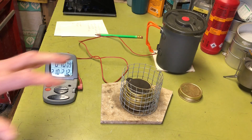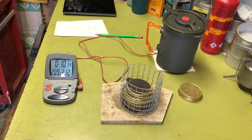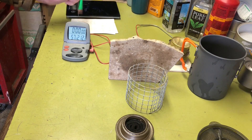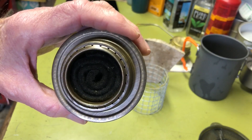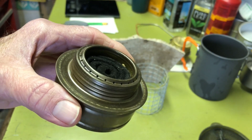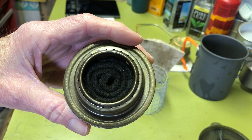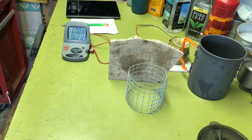I'm going to let this cool down so I can measure how much fuel was used, then start getting set up for the next test. I weighed the fuel usage and the first burn used 22 grams of alcohol. Now I'll start getting set up for the second one. I went ahead and put in a coiled-up piece of carbon felt — you can see it comes up to just about a quarter of an inch from the top of the alcohol cup.